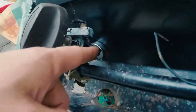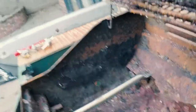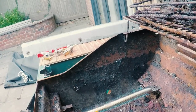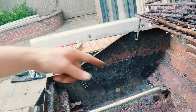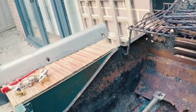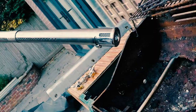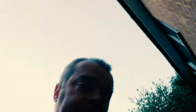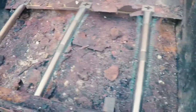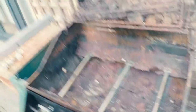What I've done is just halved the air inlet. It seems to behave better. This is on full gas now — it doesn't try and blow itself out, that's what I'm looking for. I've taken it almost two-thirds of the way closed. Let's see what that looks like. I'm pretty happy with that.